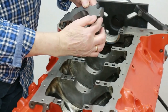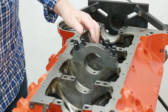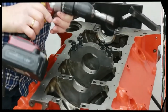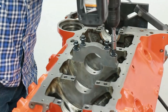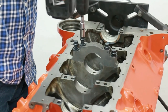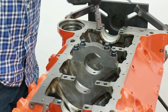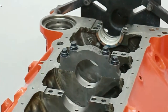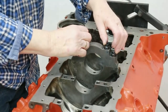A point to note: make sure this is chamfered here and here and that this edge is broken here and here. Now we're going to zip these bolts down. I'm going to use this drill set on just four foot-pounds so that I don't over-torque them. Now we've got that down. What we're going to do next is put about 20 foot-pounds on there.